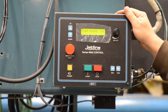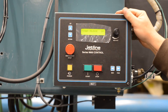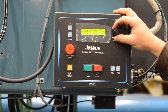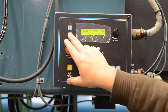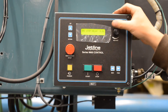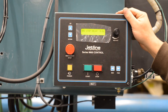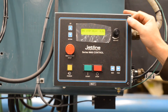Finger release is an option we typically don't use for safety reasons — it will automatically release the fingers at the end of a weld, and there is no time function, which can actually crash the torch if it doesn't come out of the way quickly enough. Arc stop delay is exactly what it means. We usually set this at zero seconds because when we press the stop button we want it to stop immediately. If you're downsloping or have a welder-controlled sequence, you would remove the arc-on signal immediately and the welder would handle the rest of the cratering.